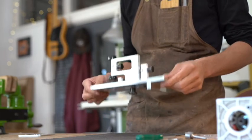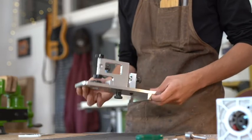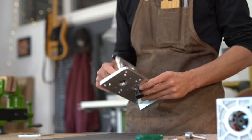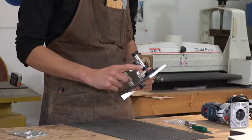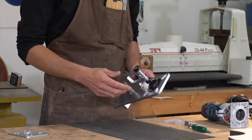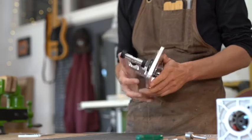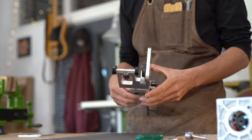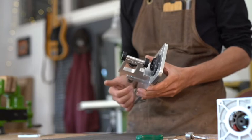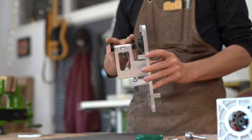With all the Elevate tools, they are really beautifully machined. This is made from aluminium. We have got the main body of the jig, which the router gets mounted to. We've got this black plastic donut, which will bear up against the guitar — it's one of the points of contact when you're using the jig. We've got what's called the zero bar, which I'll come on to in a moment. We've got this adjustable arm, which the guitar is going to rest on — the sides of the guitar are going to rest on here. It's adjustable to account for different sizes of bindings and purflings.